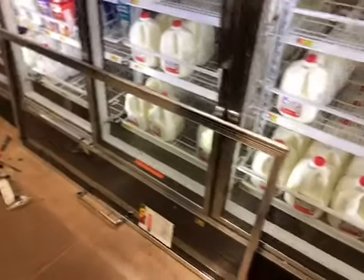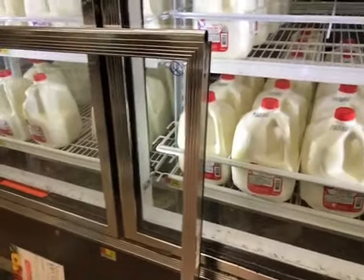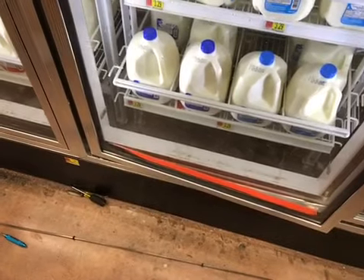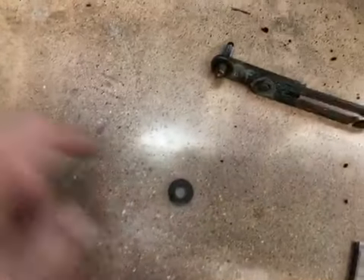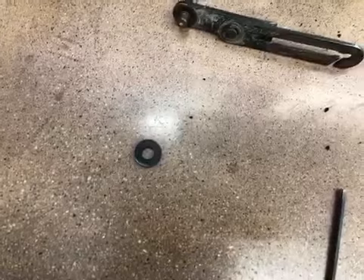When the door won't close, there are a couple of reasons that will prevent it. You will have the door that will close just a little and then drag. One point I want to show you is there is a washer at the bottom right here. This washer fits on the bottom piece. When this washer gets really thin, the hold-open portion will hang. So when these wear out, you need to get new ones and replace them. When they make them a little thicker, they won't drag as bad.